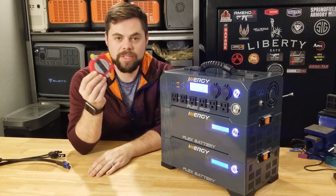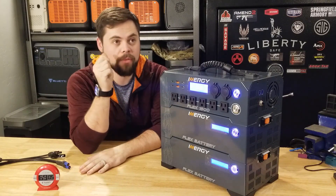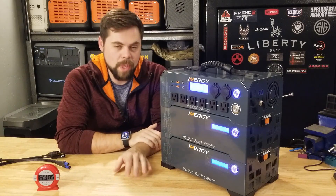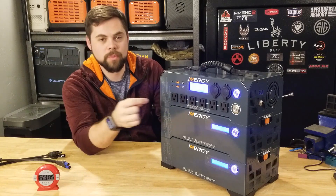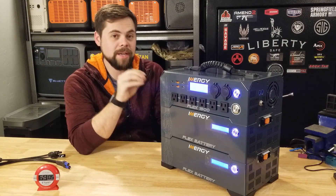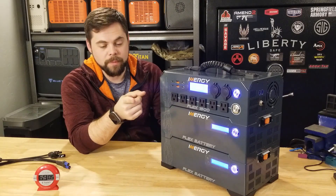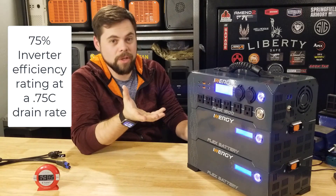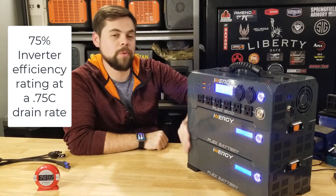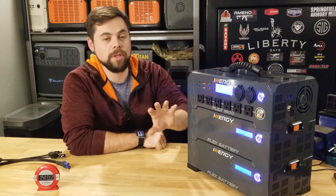We added about 2 minutes to the clock for setup. We ran for about 71 minutes, and the watt meter said we used a total of 1.56 kilowatt hours — 1,560 watt hours from the battery — that's how much energy went out through the inverter. The good news is we were able to run about 1,500 watts, though it fluctuated and got all the way down to 100 volts on the output. We ran nonstop until it reached basically 10% battery life — about 75% efficiency overall.